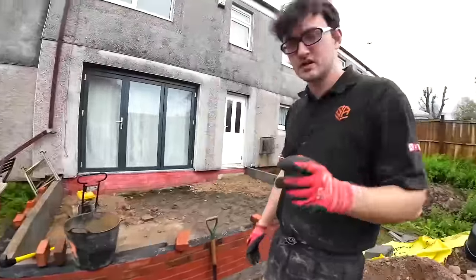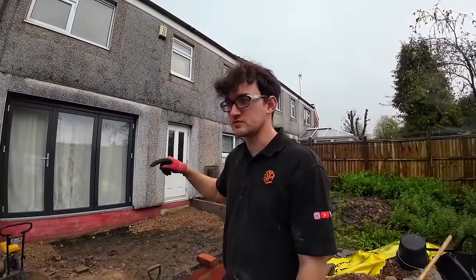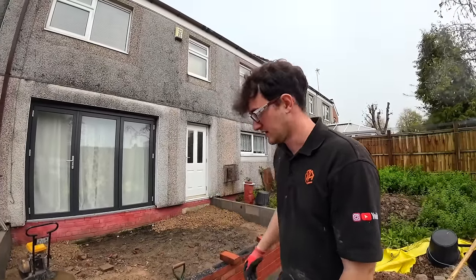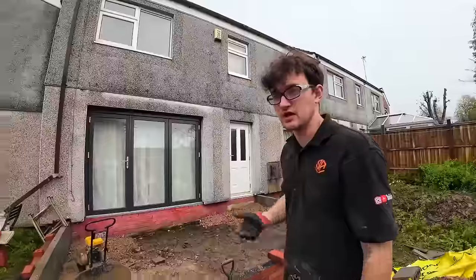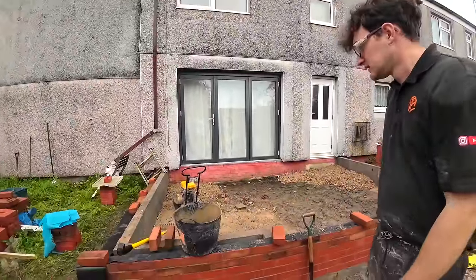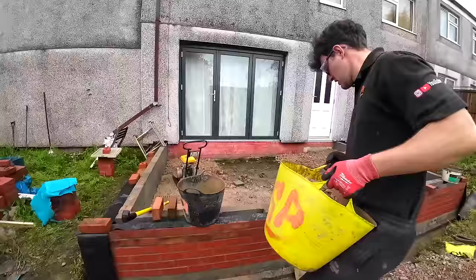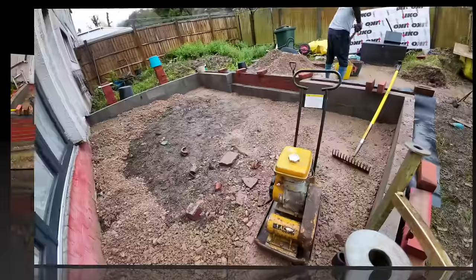I think, if you've not said already, the plan we're going to do is just get the stone in today, because with it raining all weekend probably, it's just going to get washed up. And Friday's forecast bad tomorrow. So when we come back and it's dry, we can then blind it, visqueen it and get it concreted in the afternoon. Yeah, that's the plan. Get here early, finish the prep, get the concrete on late. So, right, let's get cracking.